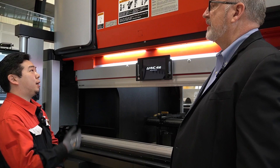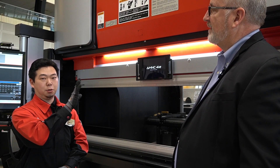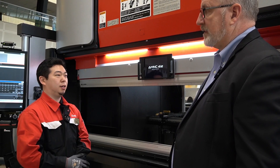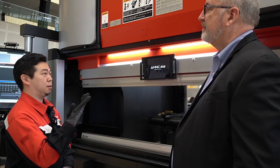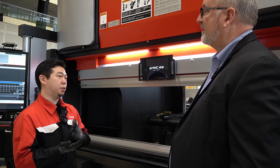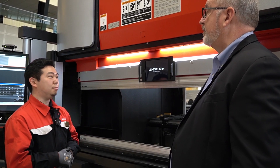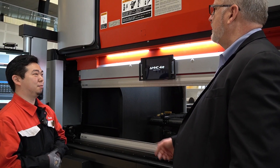From now on, this is our electric press brake, so it uses electric servos for the tonnage. There is no hydraulic system in this machine. We chose to use electric servos because maintenance will be much less intensive, it will be more energy efficient, and better for the environment.